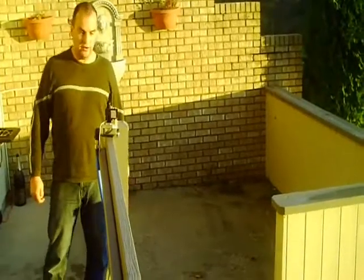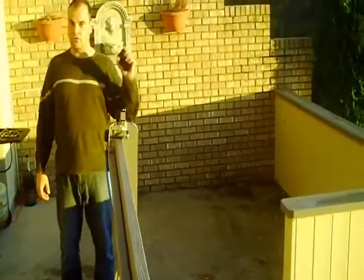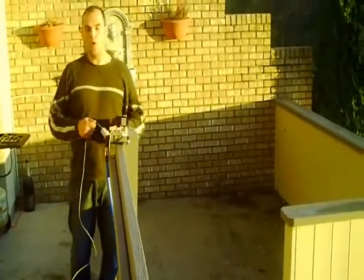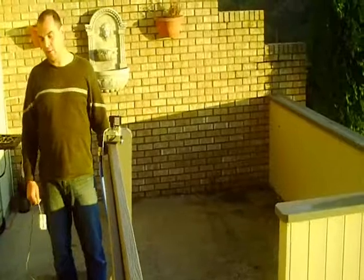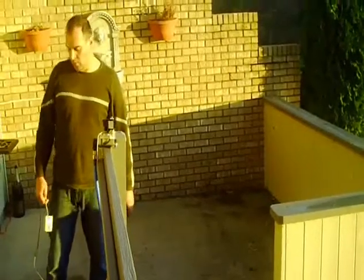What we're going to show today in our demonstration is, first of all, how the water shutoff works. We're going to turn the water on and off over the phone, and then we're going to see what happens in conjunction with the water presence sensor getting wet. The system is going to try to protect the environment by automatically turning off the water shutoff valves if any of the sensors become wet, and will also call you automatically to report the problem. Once you know the problem exists, if you choose to turn the water back on from the phone, you have the ability to do so — providing an automated way to deal with water intrusion on your property.